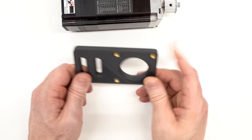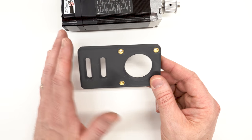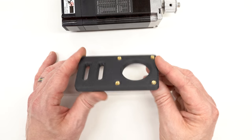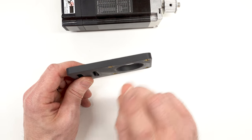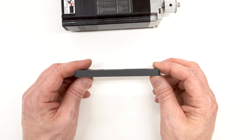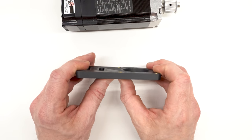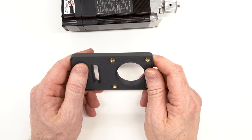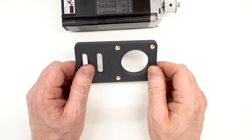I did one more thing — I've been reading about annealing nylon 3D prints. It's not really annealing in the same sense as hardened metals, but you heat the plastic up and let it soak at a high temperature for a while, and the crystalline structure and bonding between layers changes. I put this between two plates of aluminum in the kitchen oven, brought it up to 80 degrees Celsius, let it sit for four or five hours, then turned off the oven and let it cool overnight. In the morning I had a print that is quite a bit more rigid. I tested it with the weight of the motor in a vise and the amount of sag over a week was nothing compared to before — should be totally acceptable for this application.